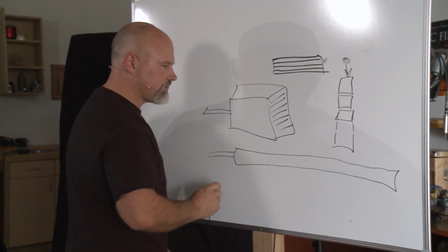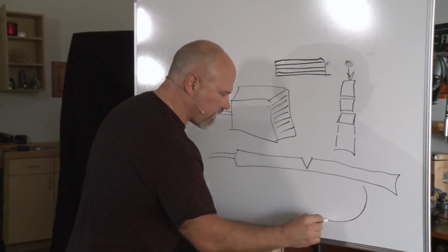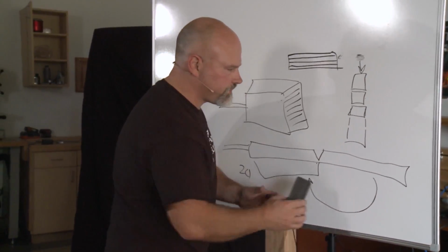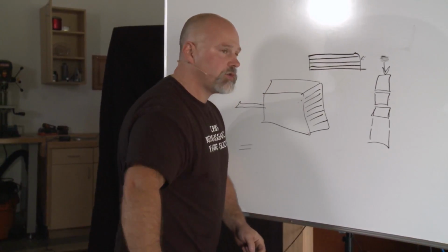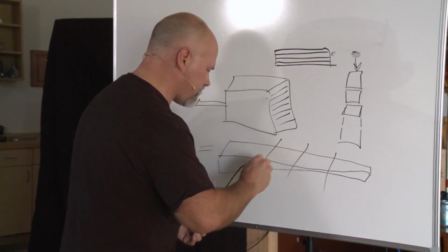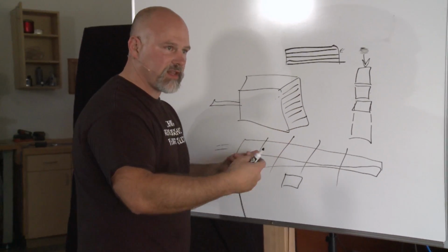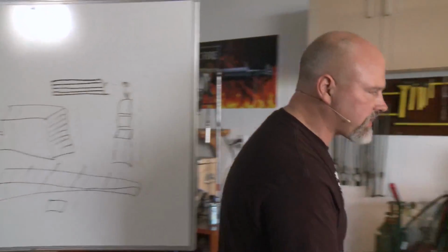into this. So I can then either cut it 3/4 of the way through and then weld it back on itself, and this will double the layers. We now have 24 layers. Or what I more often do, and is the worst part of pattern welding, it sucks, is draw it out very long and cut it into as many pieces as you want and stack it on top of itself. So if I started out with 12 layers and I draw it out and I cut into 3 pieces and I stack it, then I'll have 36 layers. Just do the math from there. So you can go up to as high as you want. Let me rotate this, I'll be right back.